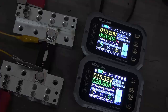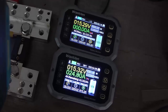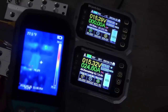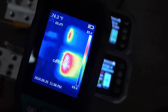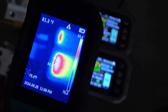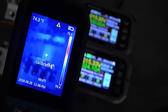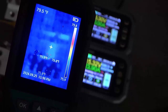To measure everything today, I will actually be using a thermal camera here. It will be set to show us the highest temperature on the screen — that is the upper right hand corner. You can see right now the highest temperature point is actually the monitors. If we look over at the fuses, there's no substantial heat to speak of. We're at about 72 degrees at the fuse.